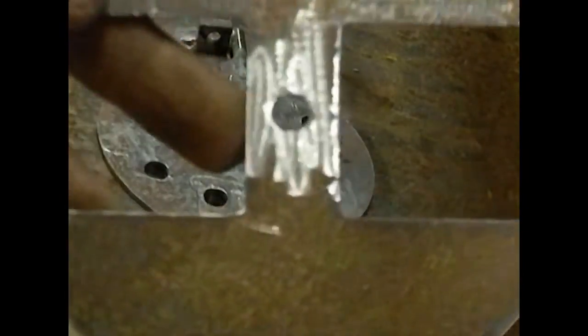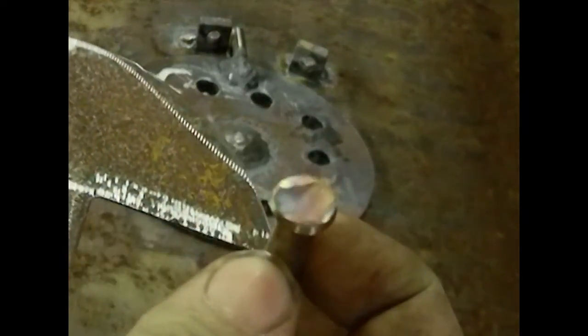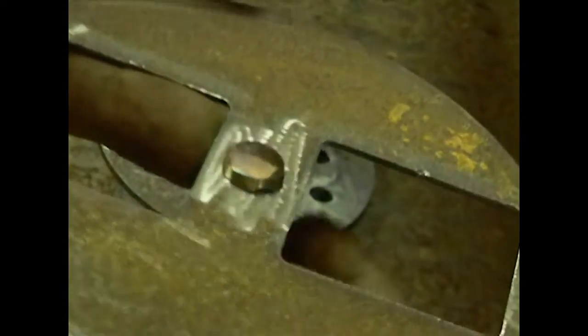For the bigger pinwheel for the air inlet for the stove, what I've done is actually shaved down the top of the bolt and flattened it out significantly. That'll allow me to create that dome without having to use so much heat. I'd say I took about half of the thickness of the bolt head off. When I weld that in, it shouldn't distort the metal nearly as badly.